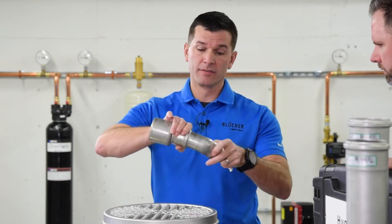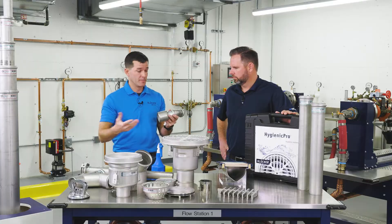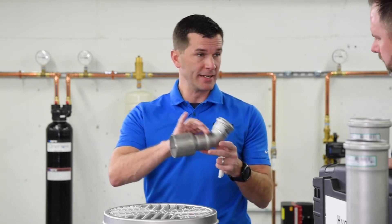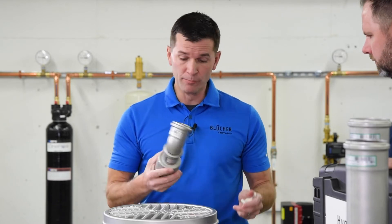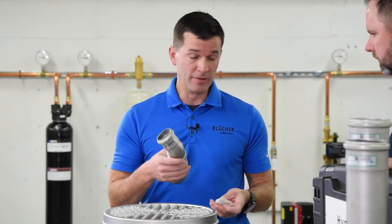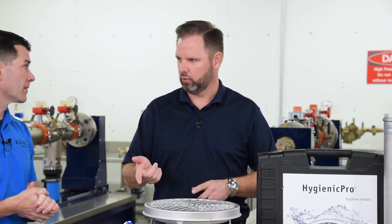The key is in the socket — the spigot end goes past the gasket, so you'd need a backup in the system for any waste to get into that gasket. You're not making any direct contact with the connection piece or the gasket, so from a degradation standpoint it gives more longevity. Blucher brought out the gasket system in the early 1980s and we've yet to have a failure or a degradation of a gasket. So there's a domino effect: not only are you saving time because it assembles so quickly, your labor is going to be reduced on a job site too.